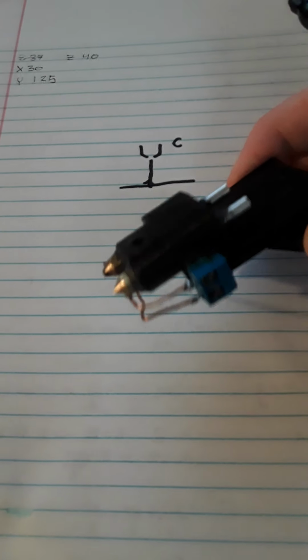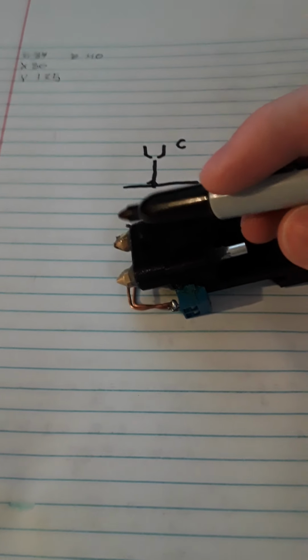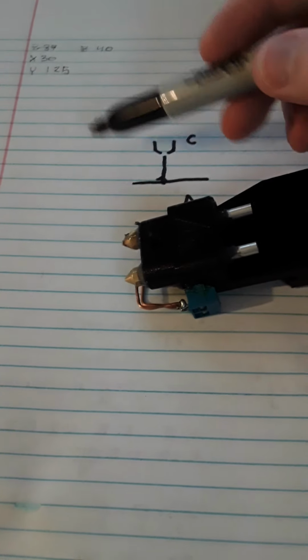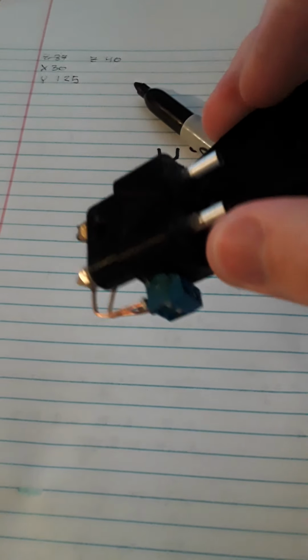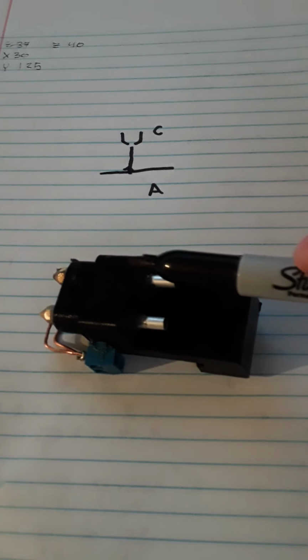I've been running into problems with this electrode, and let me go over this quickly. This is two nozzles, so it's sort of like dual extrusion. You can use two nozzles at a time. This would be a 1mm nozzle for a much wider saline spray, so if you wanted to cut wider channels, and this is a 0.2mm for much finer features. And they're just nozzles that are glued in here with hot glue, and there's epoxy connecting them to an aluminum tube. And the idea is you attach aquarium tubing, which is pumping the saline from a peristaltic pump through here.